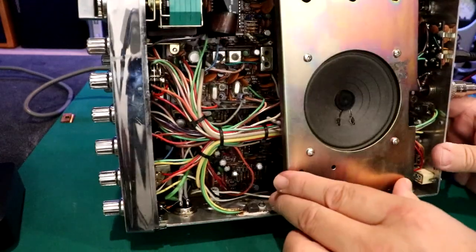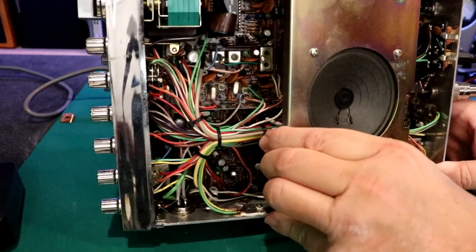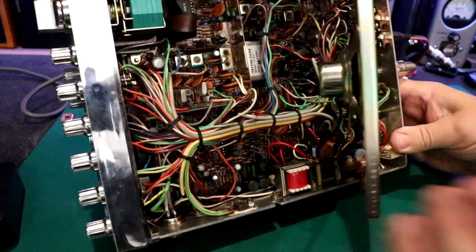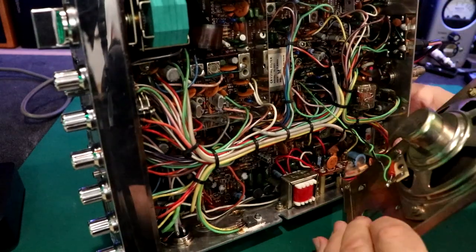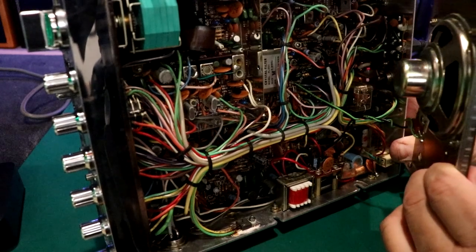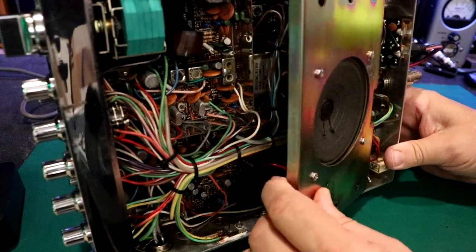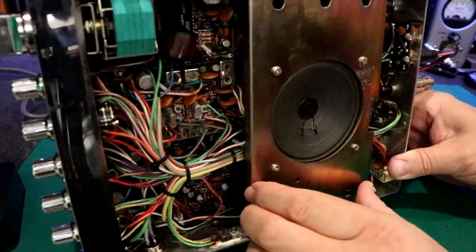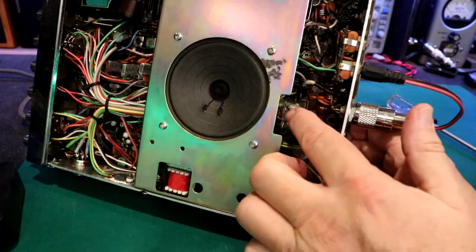What's the serial number on this? It's in like the 8 million series, it looks like. So this radio is probably from the vintage when all of those mods and repairs were actually, well, they weren't mods or repairs anymore. Yeah, that looks pretty good. Relay switching. So if you guys have ever seen microphones that have the E and the R on them, you would put your microphone on R for this one. It's our little relay.